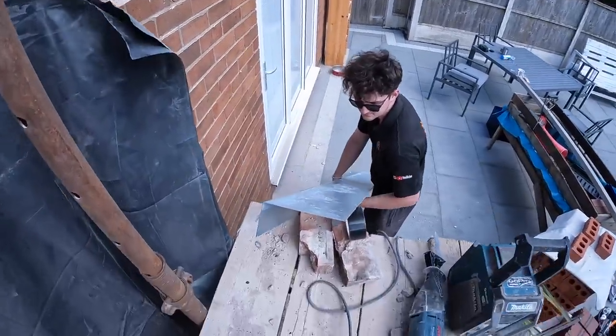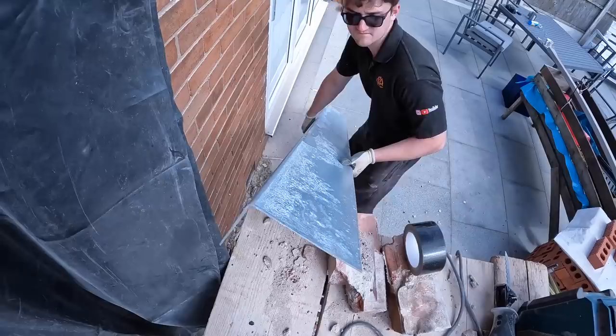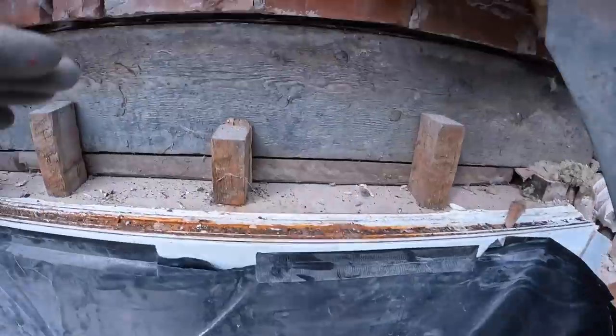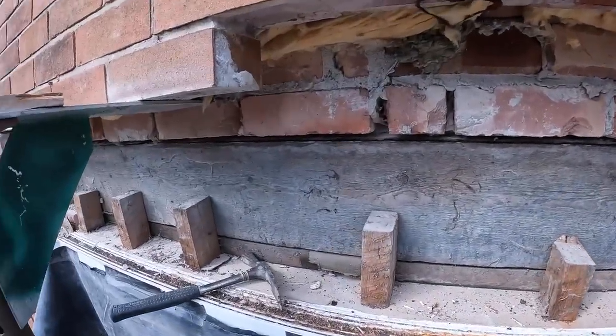Alex has just brought a lintel around. As you can see, a bit more of an upstand. A bit more of a bed on it. I don't know what the base bit is. Anyway, so the upstand takes the flex out of it. I've got plenty of room to get that in. I think we're going to try and get the tray in first, because it's going to be very awkward getting this tray in.